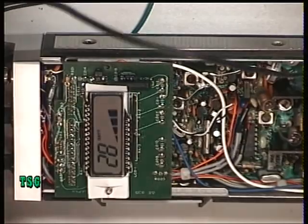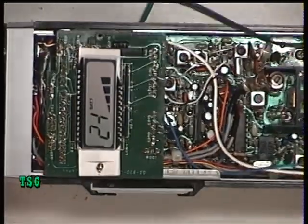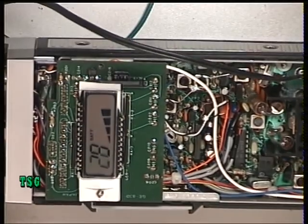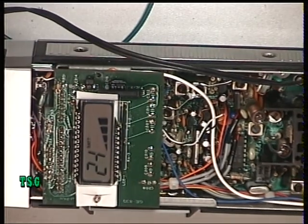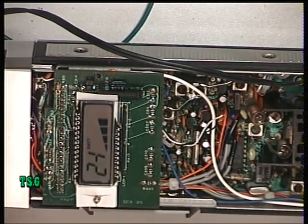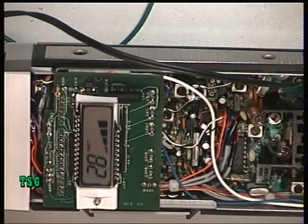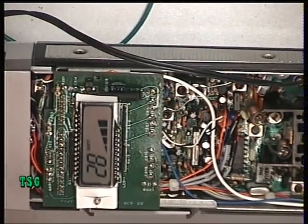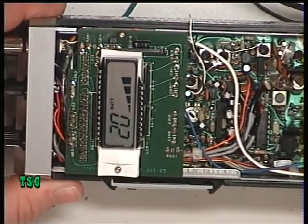The final problem with this radio: putting the LCD display back, we've got it showing 28 and it's 20. So we've got that segment bar on the units digit on all the time. I don't know if there's anything I can do about that, but we'll just look for dry joints. There we go — display now operating as it should do.